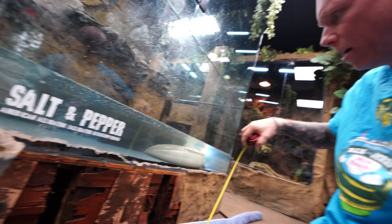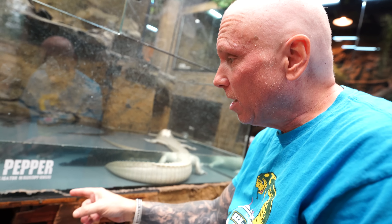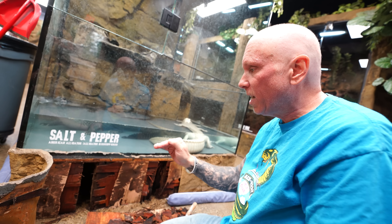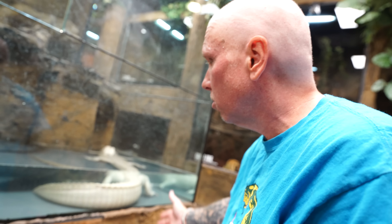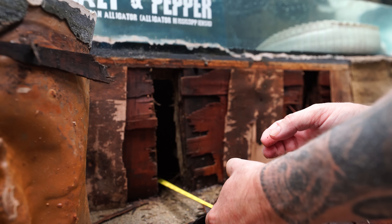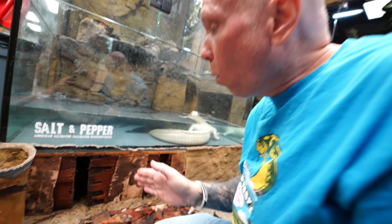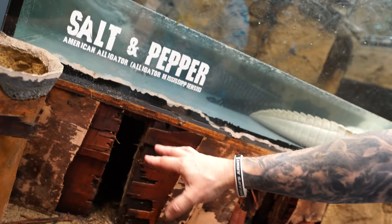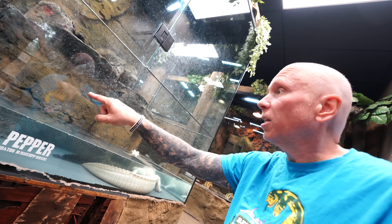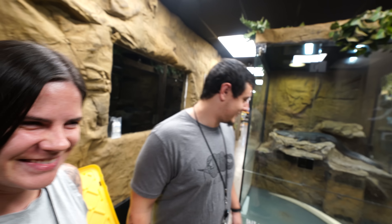We need exact measurements here - can't be even a little bit off. It's at just over a quarter, so I'm gonna go ten and three-eighths. Ten and three-eighths here too - that's gonna be just barely bigger than the opening, about a sixteenth bigger. I'll go ten and three-eighths on these two, and then we'll do one more over here just to support as well. We can go 37 inches - just making sure it's the same here - 37 inches. So we go 37 inches by ten and three-eighths. We're gonna have Steve cut me a piece of acrylic, wedge that in there, and that'll hold this all up, making the rotted foundation basically obsolete.